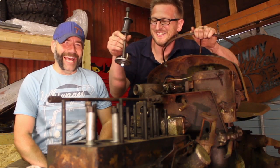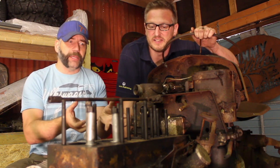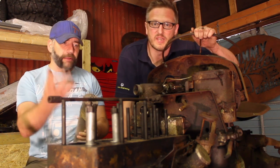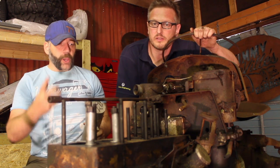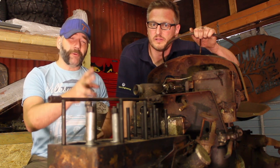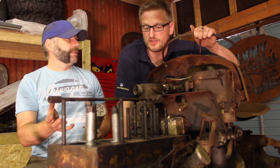So the plan with Gav's tool is to remove the cuff ring. The whole point of the cuff ring is to hold the liner in, so when we were trying to get the liner out the other day with the cuff ring in place, we were probably never going to get anywhere. We're also going to start applying more pressure to the pistons. We've also found out that even if we get the liner loose, it won't actually come out the top with the conrod attached because the conrod is too big to come out of the hole - so we've still got to separate the piston and conrod from the liner. We might have to start destroying pistons, starting with number 4 since we know that one's already knackered, then move to 3. If we've got to replace more than one piston and liner we'll probably do the full set - a replacement kit is around £200, not a massive amount of money, but really we didn't want to replace anything if possible.